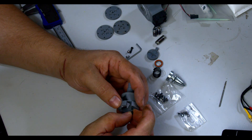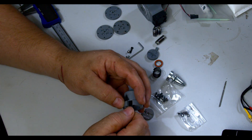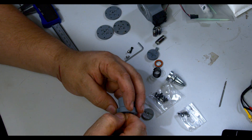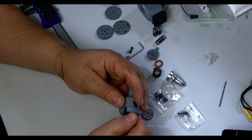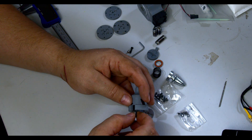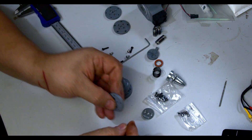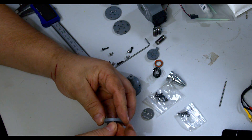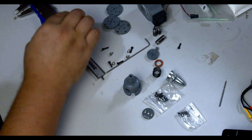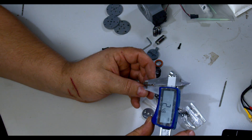So I'm just going to test our holes to make sure that they're going to be holding stuff down. Once it gets tight in the hole you don't want to push it through on resin — you just want to size your bolt to suit, so I've got some slightly smaller bolts in this one. Then when I check the clearances, as you can see it's almost clearance but not quite — I'm going to need another drill.